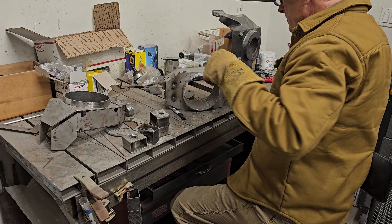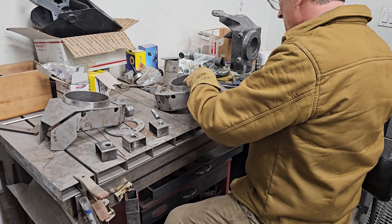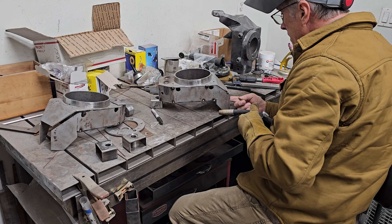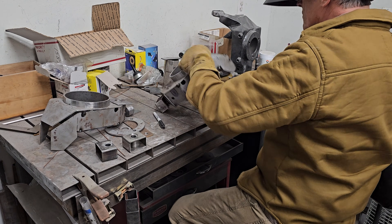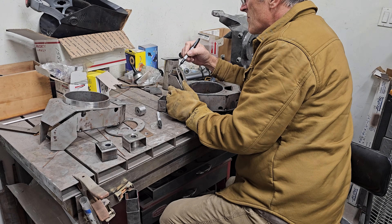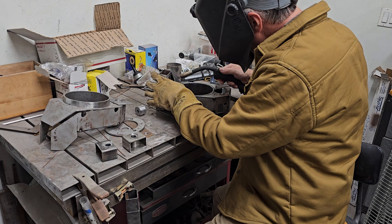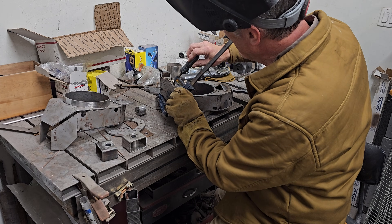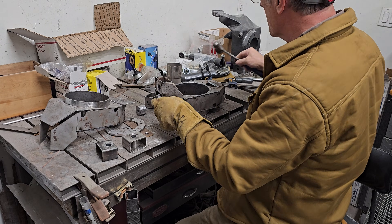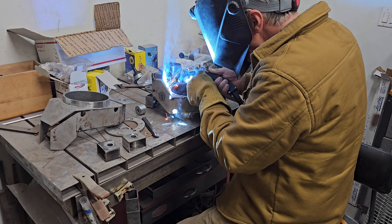As much interior welding as we need to get done before that top face slides on and covers everything up — this construction uses slot and tab construction where once it slides on, little tabs slide into those little square holes to make sure everything is lined up straight. That gives us all of our dimensional perfection, all these pieces being cut out with the water jet. This was all designed in 2D CAD, so I have to think in 3D while drawing in 2D. It would have been nice to have SolidWorks for the sheet metal function — break it all apart and create all the pieces that would fit perfectly — but SolidWorks was just a little too expensive at thirteen or fourteen hundred dollars a year when I didn't use it enough. When I am so fast in regular AutoCAD it was hard to spend all that time in there, and I really didn't have a person to help train me on it.